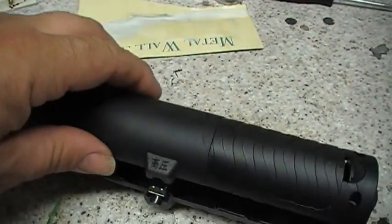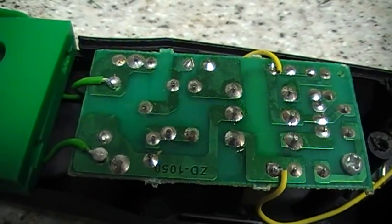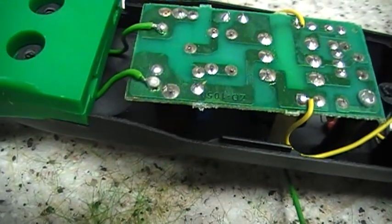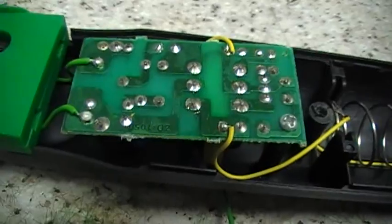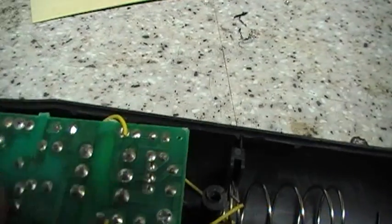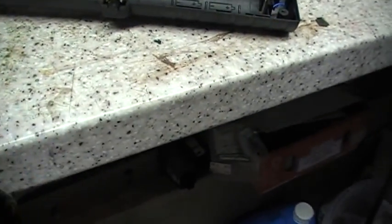I'll just show you inside what I actually did. You can just see those green cables. There was a bare cable that went to one of the grids on the fly swatter that I cut off. And the other — there were actually two yellow cables coming off from this one, and they went to the three metal grids in the head. So I unsoldered those original wires and basically soldered the tea strainer to that one there — just a little blob of silicone on it, quite neat.